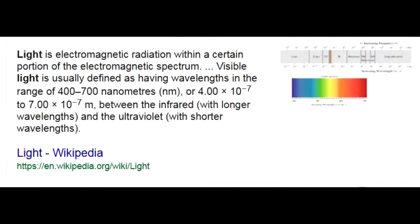If you've taken a physics course that shouldn't be a surprise, because the wavelength of light is between 400 and 700 nanometers. If I'm looking at a 90 nanometer process node, optical means — no matter how much magnification I try to get on my objectives — would never work because the features are too small to see. And of course that's how you quickly get into the realm of a scanning electron microscope if you try to bring a modern process node down to the gate level.